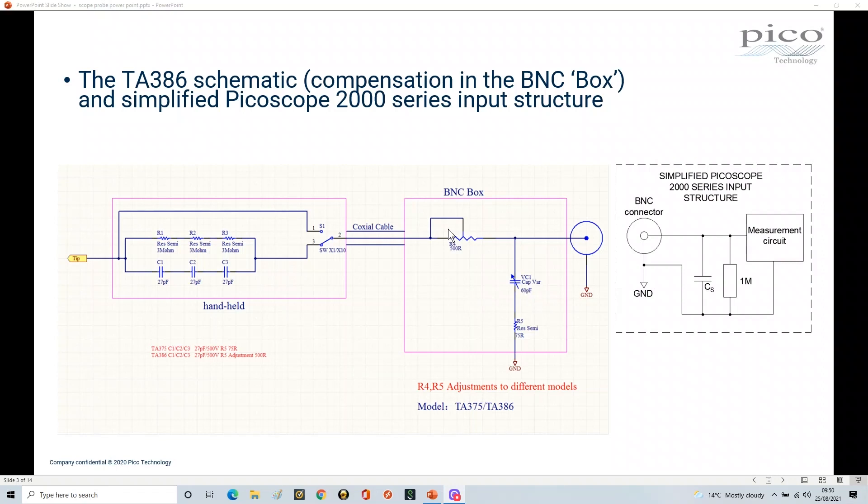What you're attempting to do is balance the capacitance in this probe to the capacitance of the actual PicoScope itself, and this is why we have this adjustment facility to balance the probe. This is a fairly involved process but it is straightforward. It goes to show how complicated these probes are, and I'll talk later about why probes can be phenomenally expensive — they're trying to give you quality and linearity from what's happening at the tip to what the scope actually sees. These are much more complicated than just a single wire from tip to scope.